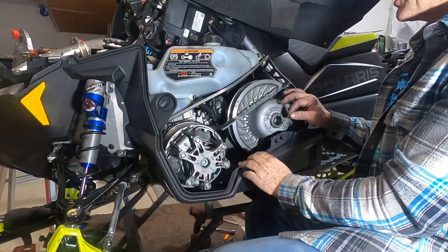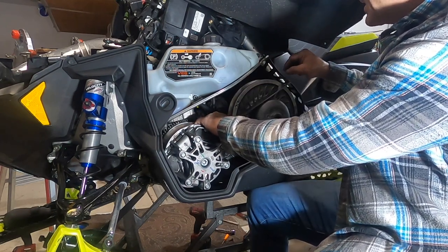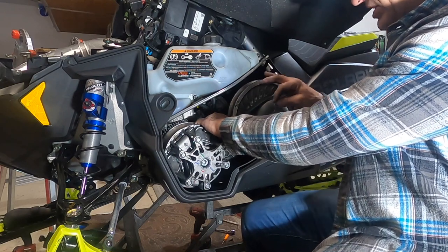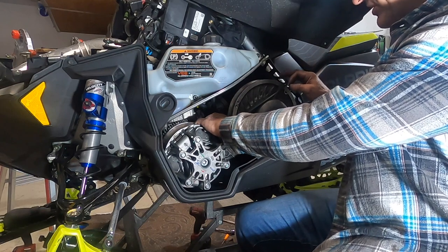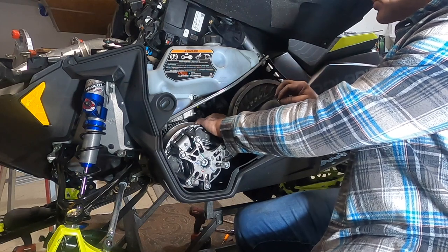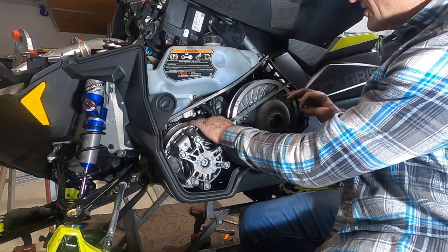Now we've moved our motor a little bit more and we've got our bar on again. We're still tight against the front, and our lead-in gap on the back is much smaller. The 30 thousandths is a little tight, so we're pretty dang close. What I'm going to do is go tighten a couple of the motor mount bolts down to see if that changes our measurements at all. We'll keep measuring, tightening the mounts, measuring again. If we can get all the motor mounts tightened down and we're still at about 20 thousandths lead-in, we're going to leave it there and tighten everything down.